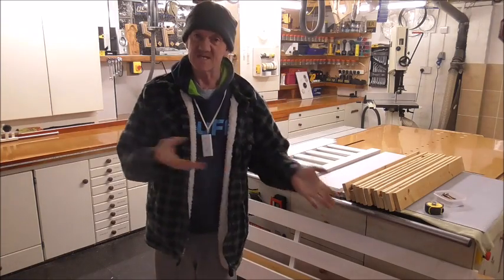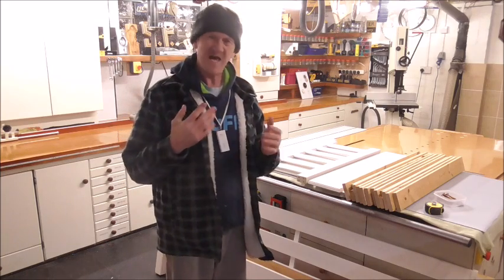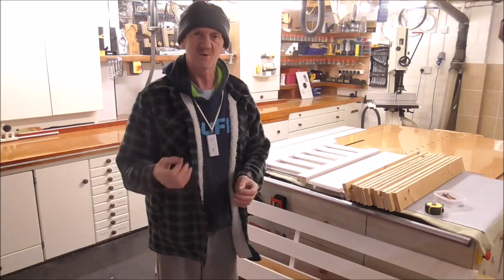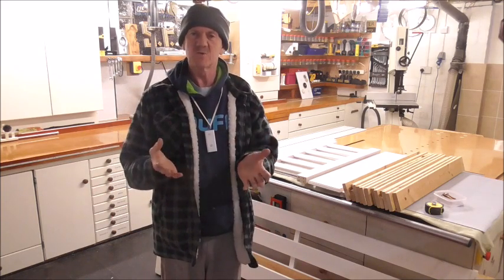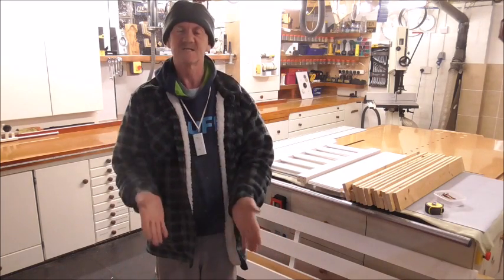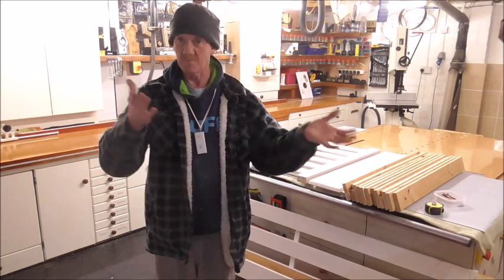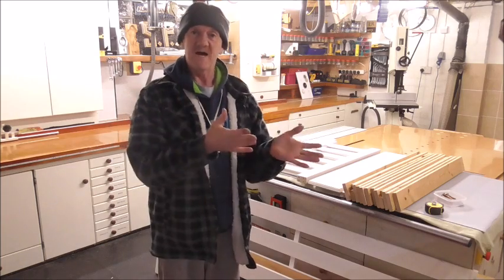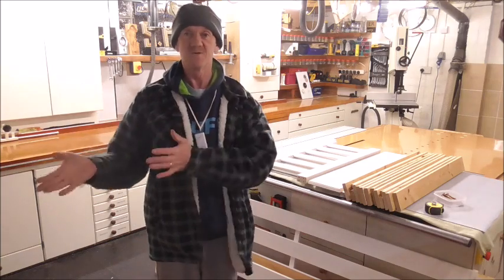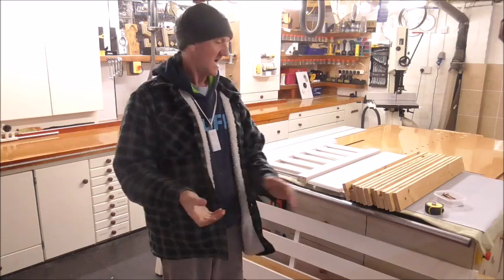On the headboard side of it, that is where the top end of the bed where the wardrobes are not going to go, because it's a lightweight manufactured type bed, it doesn't have the strength that the types I make have, so I'm not going to rely on it too much. So I think the easiest and quickest way to do it would be to extend its legs down to the floor. So I'll make some full height legs, and that way at that end of the bed it's still standing on the floor. I will still screw it to the wall to stop any flexibility going on, but that stood solid on the floor without obstructing his under bed play area, and the other end stood on the wardrobes. So we've got a good solid structure up there in the air.